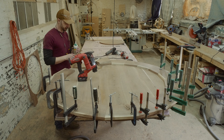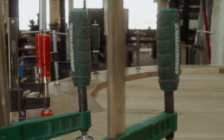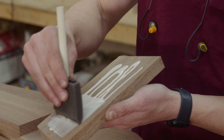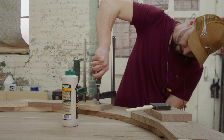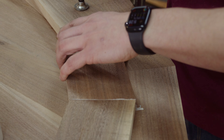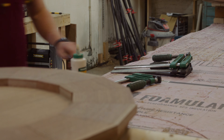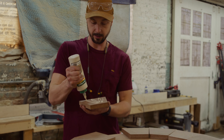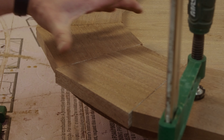Using the nails allowed me to do a little bit more in that one day, because the extra strength from them acts as the clamp while the glue is drying. On the big dining room table, I added two layers of walnut around the sides of the circle, and only one layer on the high-top tabletop. I was really excited with how both tabletops were coming together, and with this being the biggest round table I'd ever made in walnut, I was kind of just waiting for something to go wrong.